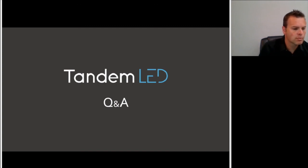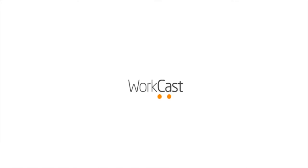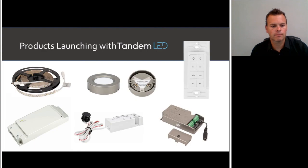Let me pull this picture up here. The power supply itself has a screw-on cover. If you look here, it's the bottom left picture. You just undo the screws, and there's teeth inside of here. When you insert your Romex connection back here into 2 screw terminals, the cover plate goes on and secures the wire. So no, you do not need the power supply in its own box or its own enclosure.